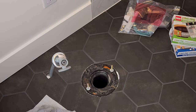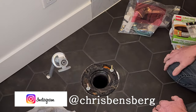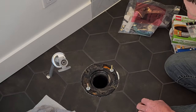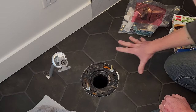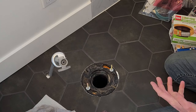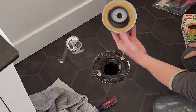We have our toilet flange right here — this is an old one. If you have new construction, it would just be black ABS plastic. This is the original flange from the home build, but my tile job all around it is brand new, as is the Ditra waterproof membrane underneath. Definitely watch the channel videos for that process. If you did not buy a new toilet and are just reinstalling the old one, you'll need to get a new wax ring — they come in different sizes.